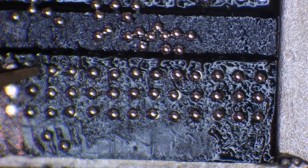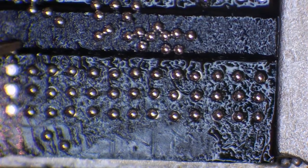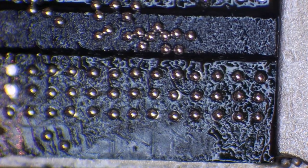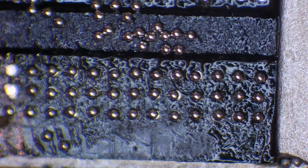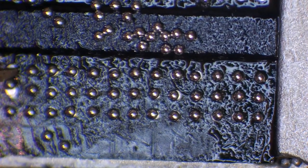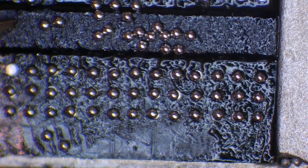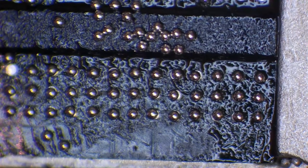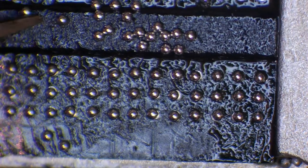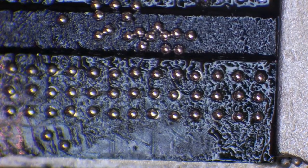What I would do is I had a USB-C to HDMI converter for my phone, and I'd basically use Cozy Magnifier and hook my phone up to a monitor using HDMI, and then use a mount. Basically I had a very cheap microscope, because I already had the phone. The phone I use is a Samsung Galaxy S9. I've had it since launch. The HDMI converter cost me, I think, around £14 on Amazon. You can get them much cheaper on eBay, but I wanted one there and then because I'm impatient. And I basically turned my phone into a microscope. I obviously already had the TV, or the monitor rather.